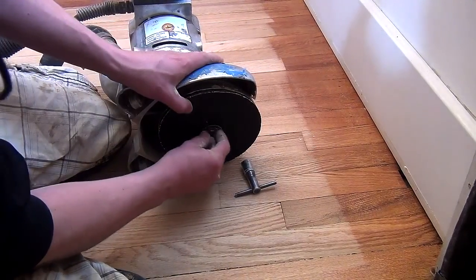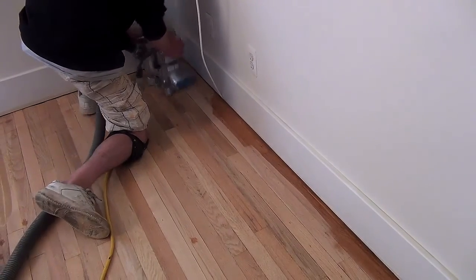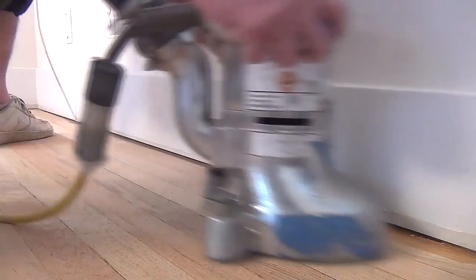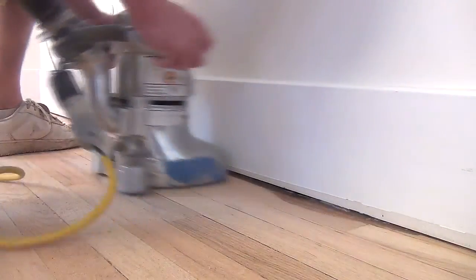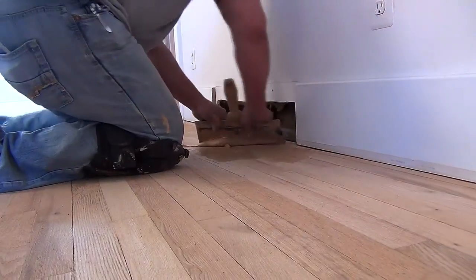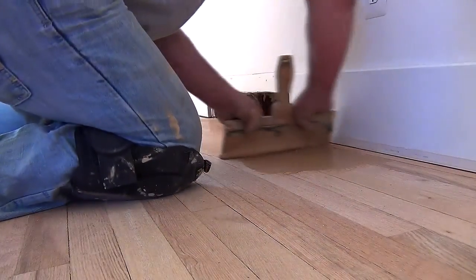I don't think I've ever heard of a square buffed edger, have you? An edger is a tool the pros use to sand around the wall lines to create an even consistency with the drum sanding. Here the finisher starts with a rough grit edging. Here more crack filling continues with the floor filler.